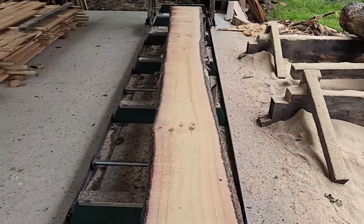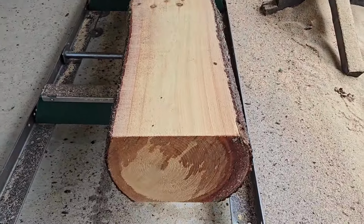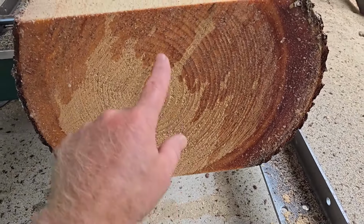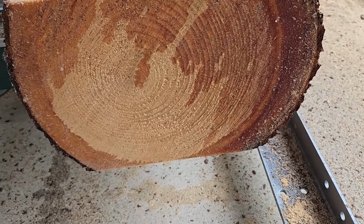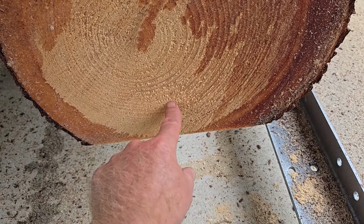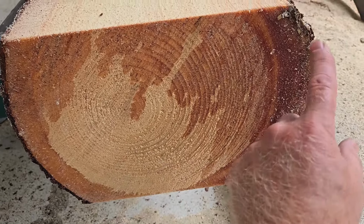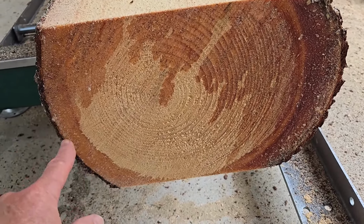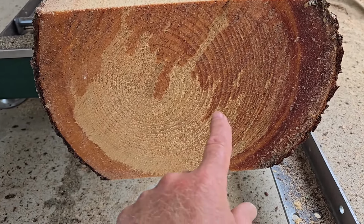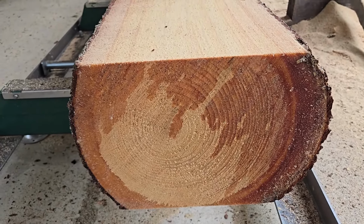So we took that last 1x off of there, so we got 2 1x's off of this side here, and we got 1 1x off the other side. So now we have 9.75 the distance here. So we will take 1.75 off of here and make a 1.75x8 out of this bottom side, and then we'll be ready to make our cant, and we'll get some bonus wood off of these as well on both sides. And we'll get down to that 10.5. That'll give us 6 more pieces there. We should end up with 7 2x8s out of this log, and then a bunch of bonus wood.